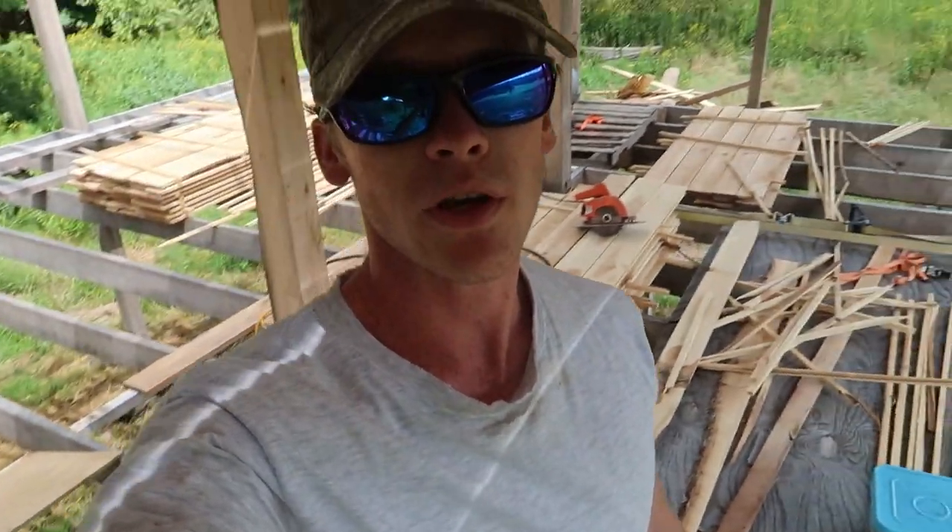First off, we are gonna do a whole bunch of work here on the sawmill shed. We're still continuing on with getting the sheathing up. We got the short side done last week; we're gonna be working on the long side this week. The first thing to work on today is getting all of the boards up here on this floor cut to length and up on the roof, because with rough sawn lumber it's not cut to length — it's just cut to thickness and width. So we'll do that and then start getting it nailed up on the rafters.